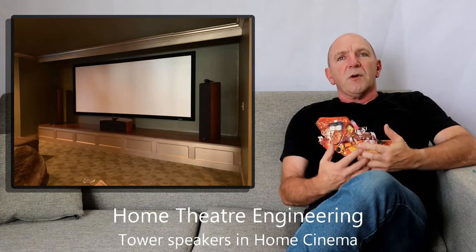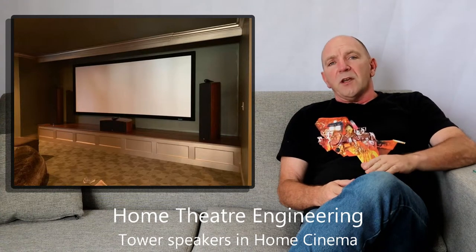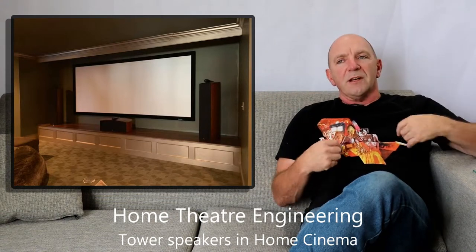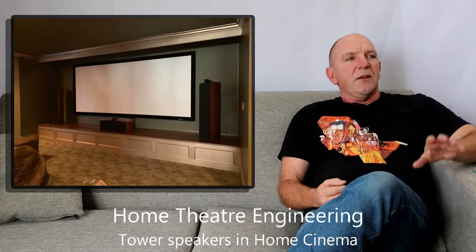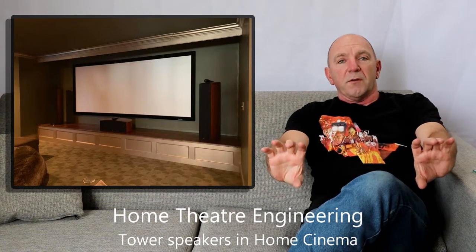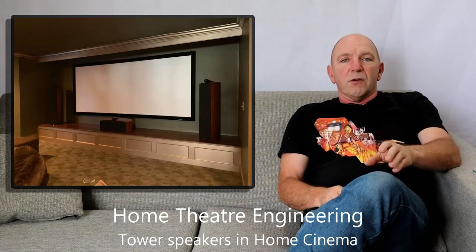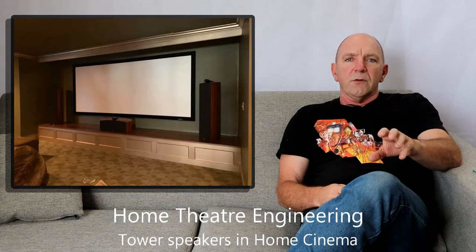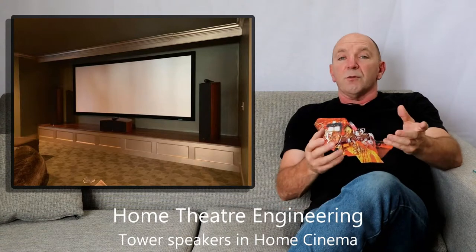In terms of the midrange and tweeters, sound becomes more and more directional as the frequency increases. So what we try to do is get all of the tweeters at head height so that we are consistently getting all of the clarity we want from the audio. One of the things I see incredibly often is you've got the left speaker, the right speaker, and then in the centre you've got the centre speaker down in a cabinet on the ground. The only person who gets to experience great sound in that room is arguably the dog — they get the centre channel but they don't get the left and right because it's way over the top of them. We need to make sure that the speakers are positioned with the tweeters at ear height.